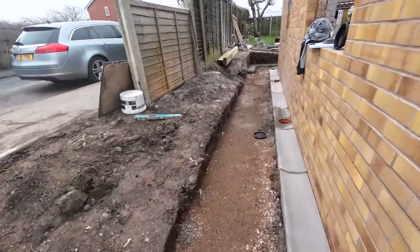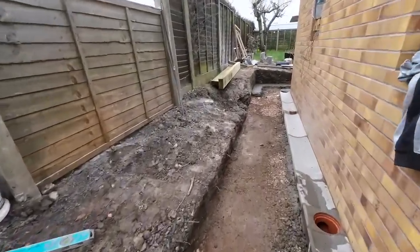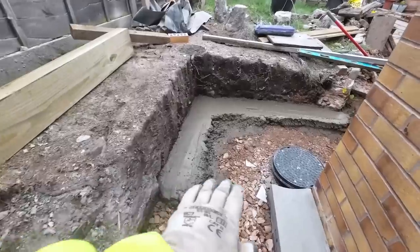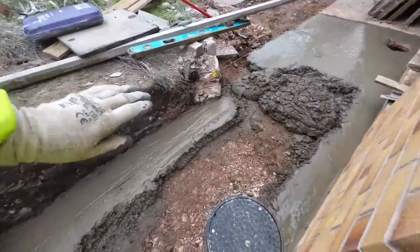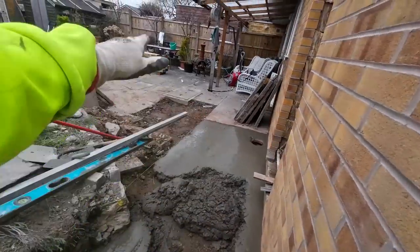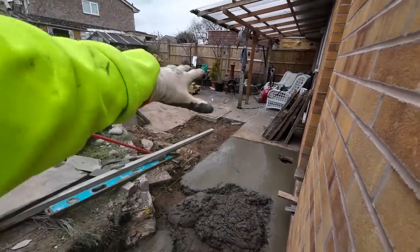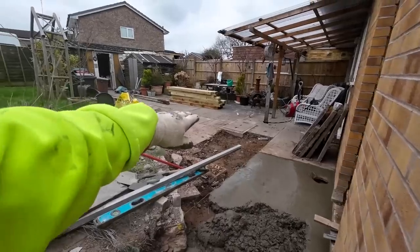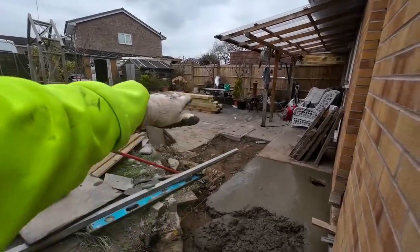So I'll just stay on time lapse. You've missed quite a bit of it so far, but I've set all my screeds up for my heights and my levels. So that falls back to here. Everything falls back here basically. This sort of route goes off that way, but we've just got to follow what's there, because the customer's going to crazy pave that bit himself, so we'll probably take that low bit and level it off.